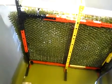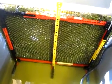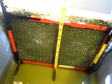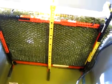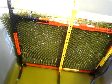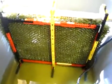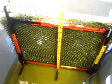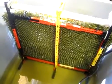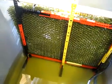It's pretty good. This is what actually cools down the air. This is called a media pad. The brand name is Cooler Pad, and you can find this at most of the big box hardware stores. I like this much better than the Aspen, because Aspen is hard to cut and leaves those bark shavings all over the place, so it's a lot harder to work with and really messy as well. So this is really easy to cut, it's more sturdy, and the cooling effect seems to be about the same, if not better, than the Aspen pads anyway, so I really like this a lot.